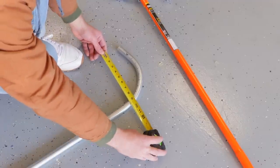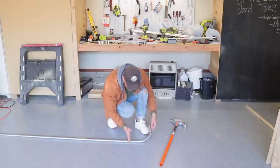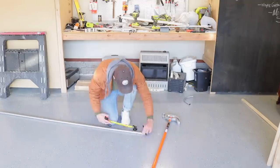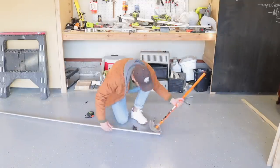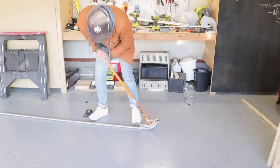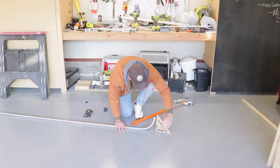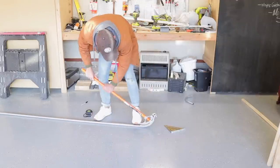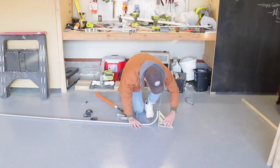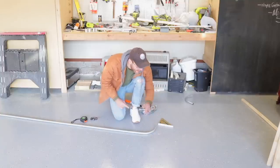Fingers crossed — oh wow, okay, so I over-bent it. Looking at how it bent I realized I don't need to start at two inches, I need to start at one. So I cut that piece off and tried again. Just like before I made marks at every inch along the conduit, then made my bend keeping a lot of pressure on the foot peg. This time I was careful not to over-bend it — I'd rather bend it two or three times than over-bend it on the first try.